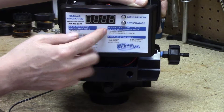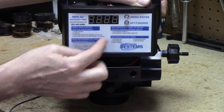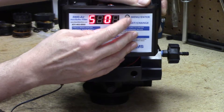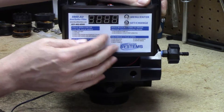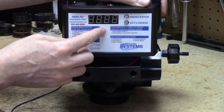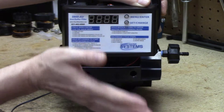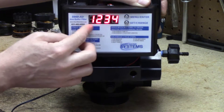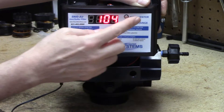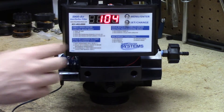The last cycle step is the rapid rinse — we want to do that for six minutes. So now we've got step five: rapid rinse, six minutes. All these cycle steps are written down there by the way. Now we're at the Bluetooth enabled setting. If you go on your iPad or iPhone and download the Legacy app, you can hook it up via Bluetooth. Leave it at one — Bluetooth is enabled, in the on position — regardless of whether you choose to download the app or not. The next setting is your code for the app, explained in the Legacy app. Press it one more time and now it's showing the clock time going back and forth with the number of days until regeneration. That's how you program an air valve, folks — thanks.